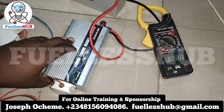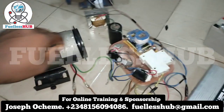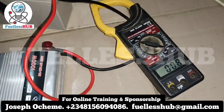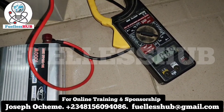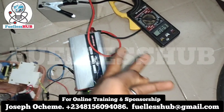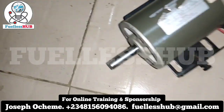Put your eyes on the meter. Everything is being powered on. This is what it is consuming: 0.8, 0.9 — approximately one amp. So this system is using around 15 watts to power this electric setup.